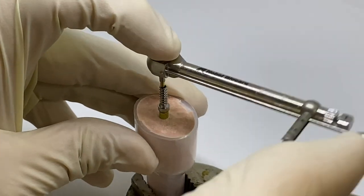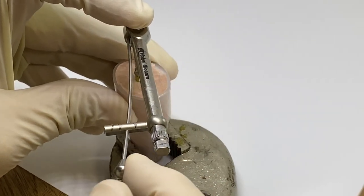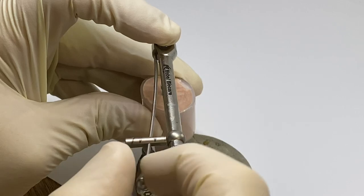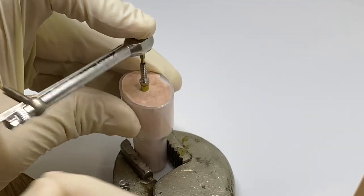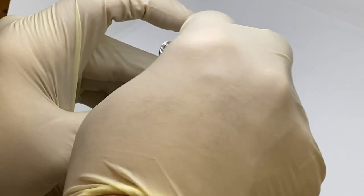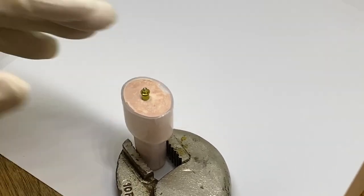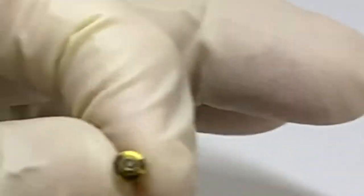As I started tightening, we're in the elastic limit up to 15 Newtons. As we go past the manufacturer's recommendation, we enter plastic deformation — the screw starts to change. As I keep tightening, you can't get past a certain level because the screw is stretching and elongating, and then we reach the fracture point. Boom — the screw let go. The head of the screw is still on the driver, and looking into the abutment you can see the screw is now fractured inside. It fractured at about 45 Newtons with a screw head fracture, and now there's a screw stuck in the abutment.